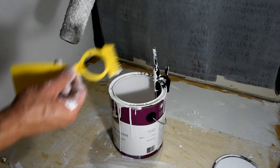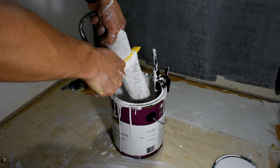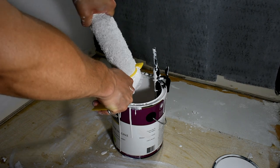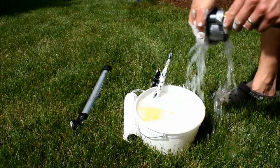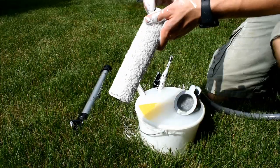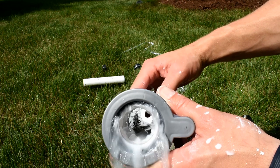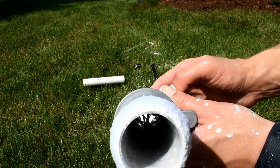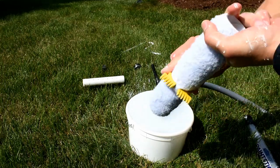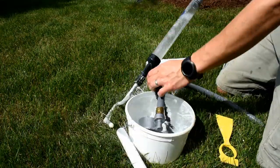When you're done, you just push the paint back out and use this handy little tool to remove any excess paint from the roller. For latex paints, you just clean up with some water. You can get a handy attachment that hooks to any standard garden hose — it forces water through the roller and pushes the paint out. After several passes through, you have a nice clean roller that can be reused on another project. The tube can also be cleaned by drawing water in multiple times and just flushing it out.